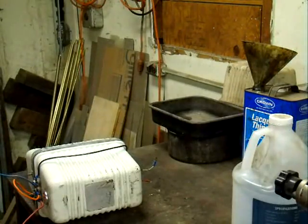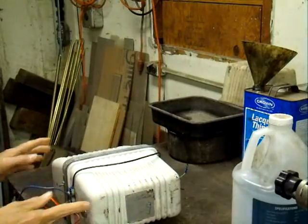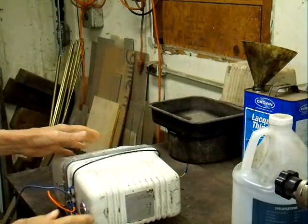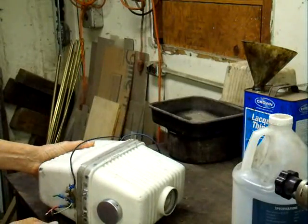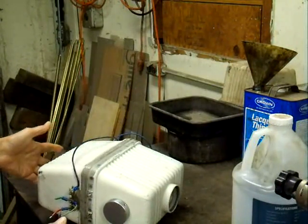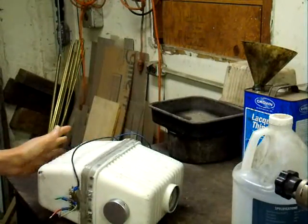This session we're going to open up one of these General Electric X-ray machines. This one has a short circuit in it. The B-plus transformer pulls extreme current and nothing comes out of it, so it's useless the way it is.